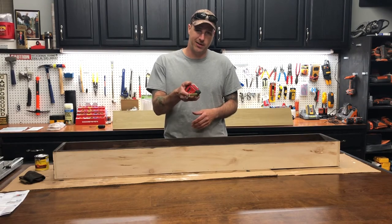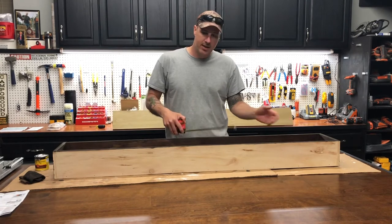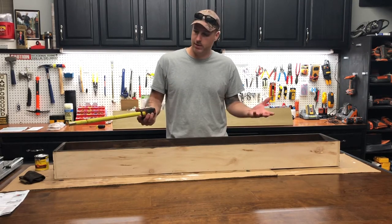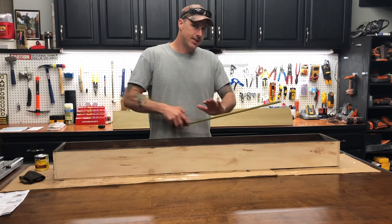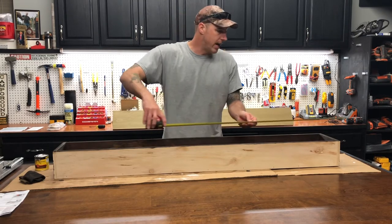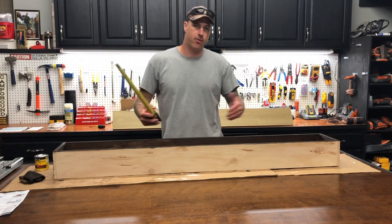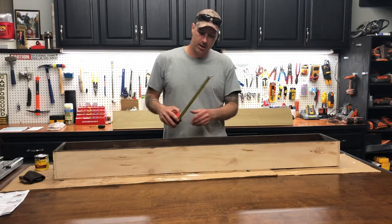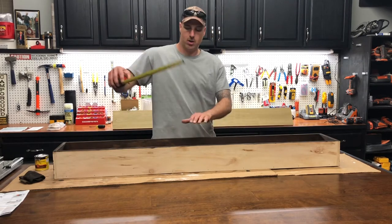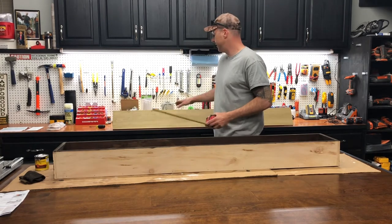The first thing you see is the box for the compartment is already done and already stained. I made it out of three-quarter inch pine plywood — super expensive right now but you have no other options. What dictates the size of your mantle compartment is how big you want your mantle. My mantle is 69 inches long so I made the box at 60 inches, giving myself four inches plus on each side for my slide rollers. I'm going with a five and a half inch box because I want a seven inch wide mantle.